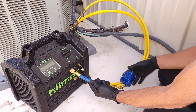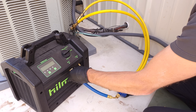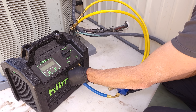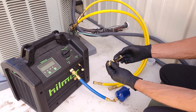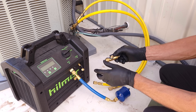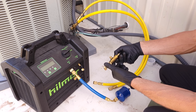We're going to attach this to the inlet — this is just a little extension hose — because we want to have a filter dryer before the recovery machine in order to protect it, and we're also protecting the refrigerant before it enters the recovery bottle. I'm using this valve core removal tool as a T, and I've already removed the valve core out of the end, so this is just an open T essentially now.